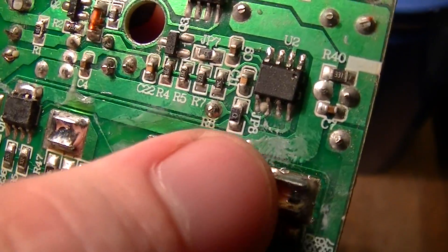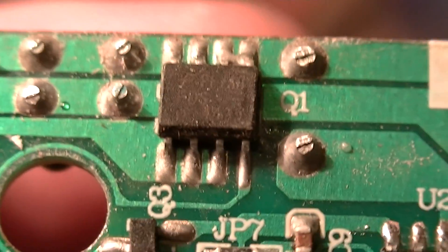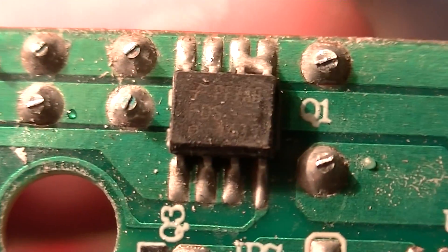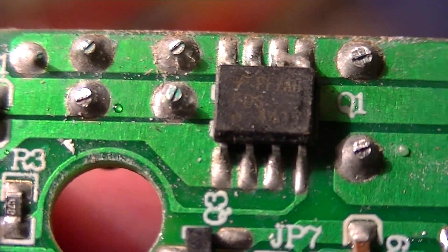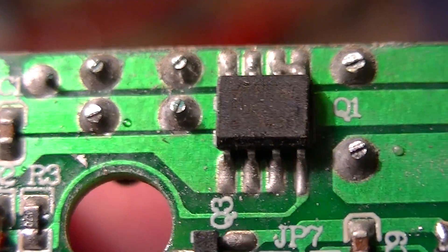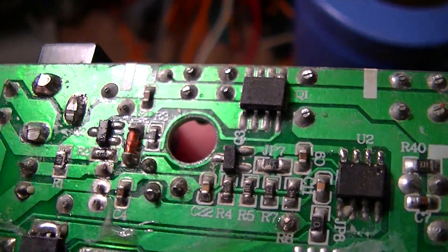There are a number of SO8 package MOSFETs — there are three of them on the board. The only one with a legible part number is marked PF78AB, which I presume is for the buck converter. It's marked as being made by Fairchild, but judging by the style of the F and the general quality of the epoxy, I think that is probably counterfeit — about 90% certainty.